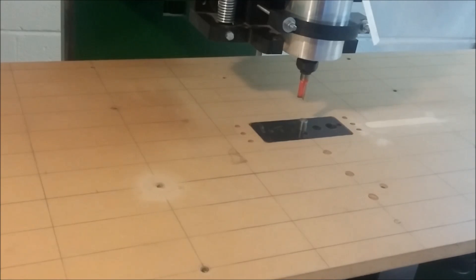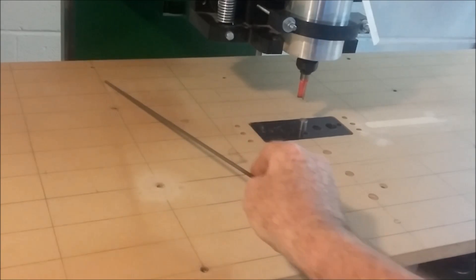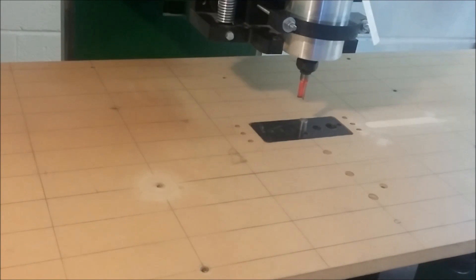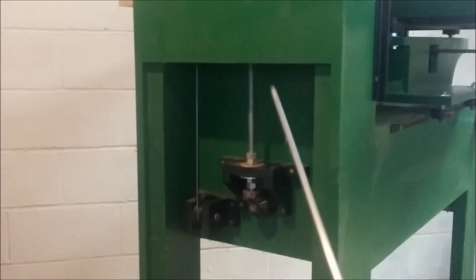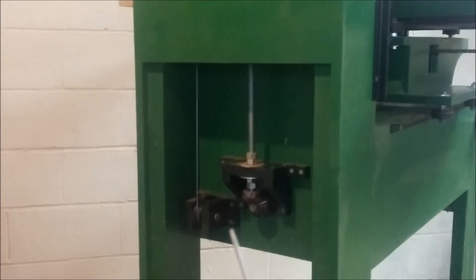As far as clamping things on the table, I have many threaded inserts — a series of four here and the same series of four over there. I've got different plywood pieces and different apparatuses to clamp and hold things to the table. Now this is the back side of the machine. You can see I'm using bevel gears — a five-eighths shaft coming through with a bevel gear on a piece of half-inch threaded rod that drives the arm up above. And this is part of my cable system for the plunge feature, threaded through the back of the slot and with a guide for the threaded rod up above.